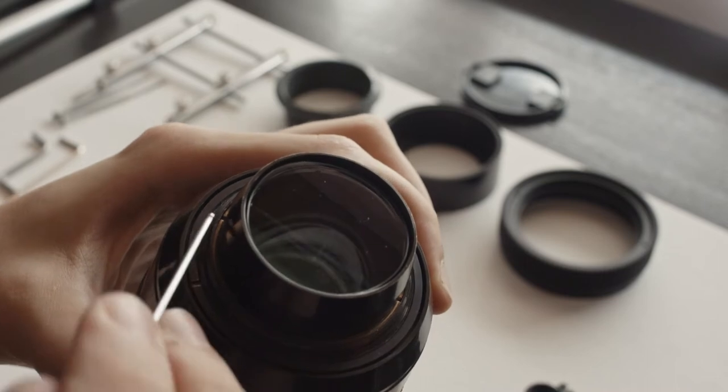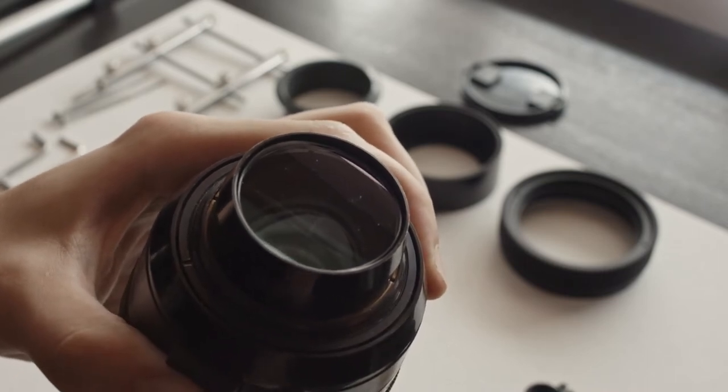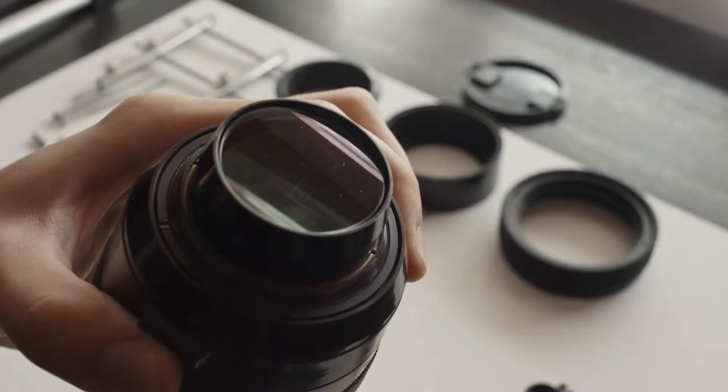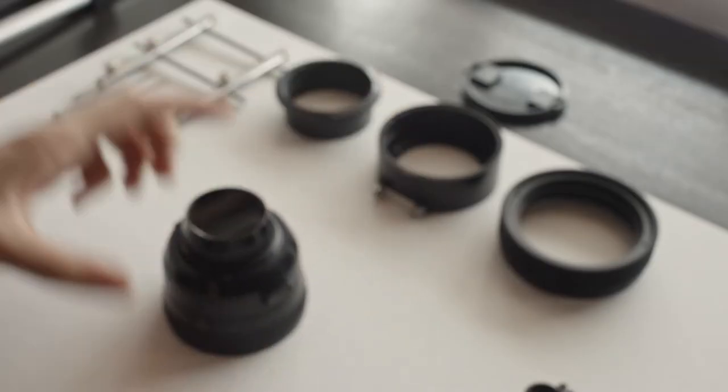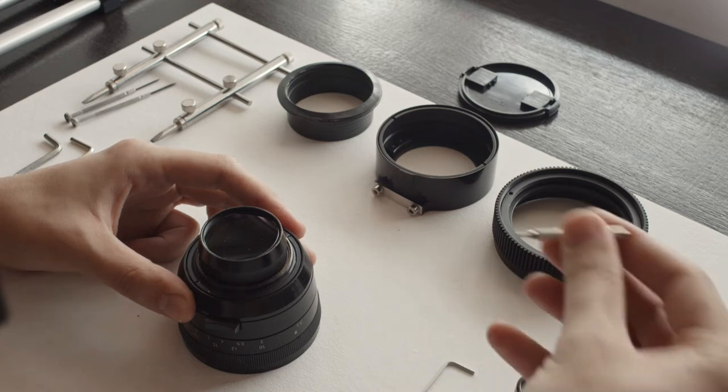For the pre-36 it is slightly wider and has a little retention screw of its own. You have to get rid of that screw first and then start unscrewing the retainer ring, which we are going to do right now using the same flathead screwdriver.